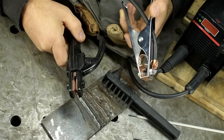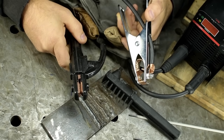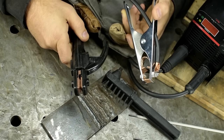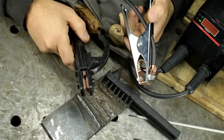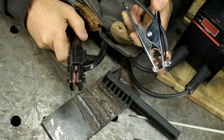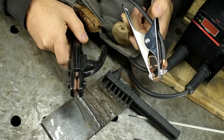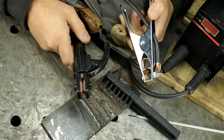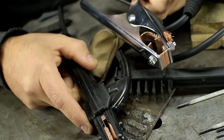Not surprisingly, perhaps, the ad for this welder doesn't list the open circuit voltage. So unless you're already used to swearing a lot, and based on my 5 minutes of trying, I wouldn't recommend this for 7018s. 6013s? Spectacular. 7018s, not so much. And frankly, you could weld your whole life without ever even thinking about buying a pack of 7018s. Though here comes the wrinkle.